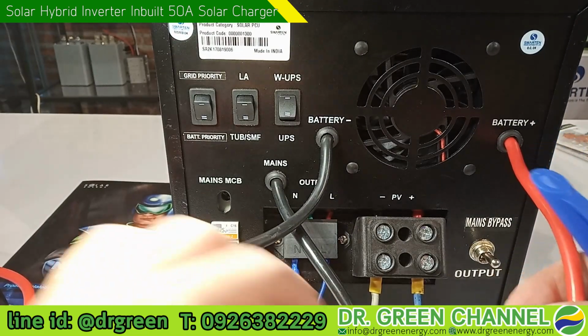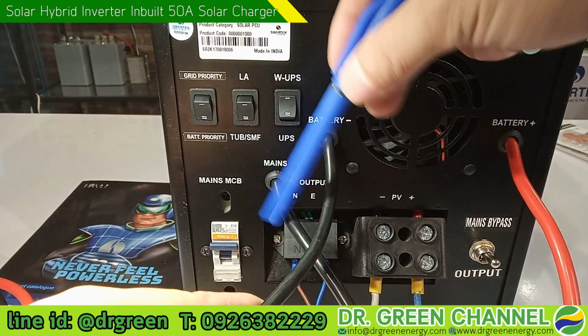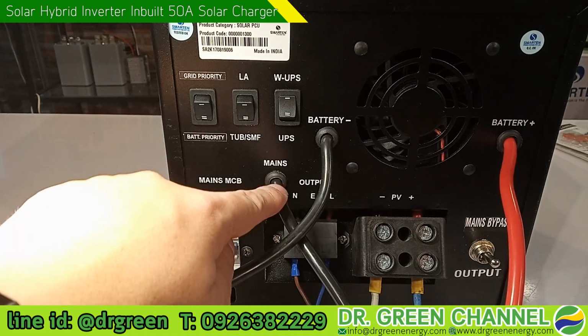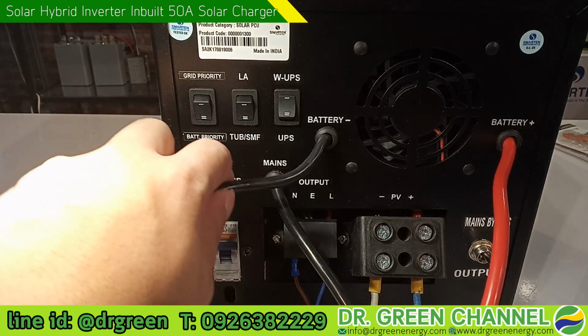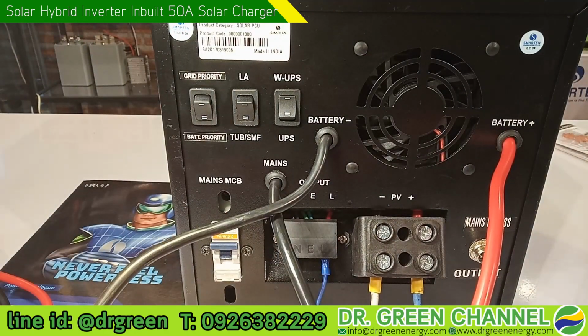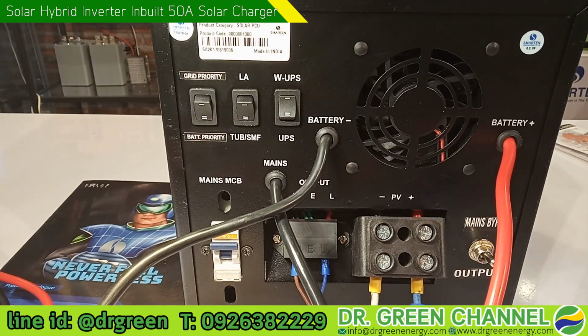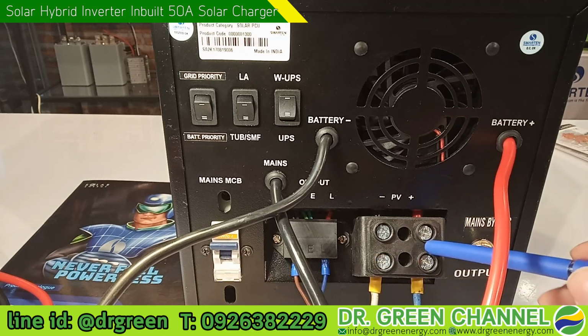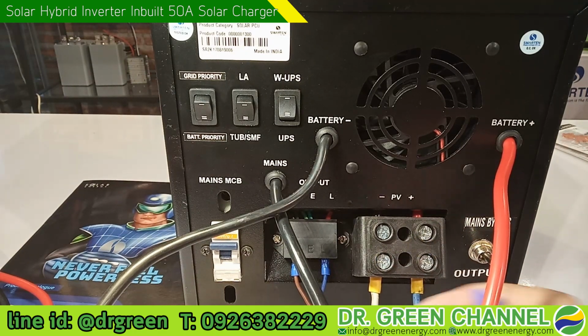And the next one is the power for the mains. If you are using it as a hybrid solar inverter or UPS, you just put this cable with the AC input power. And the next one over here is the PV input. This one has a built-in solar charge controller. On this end is the positive, and on this end of the terminal is the negative. Every time you install, you should check very carefully and tighten the screws. Make sure all the screws are tight. This is the positive end, and this is the negative end.